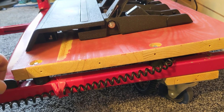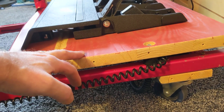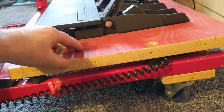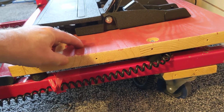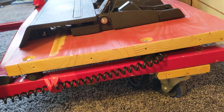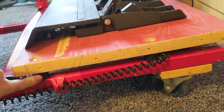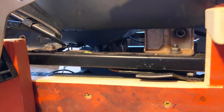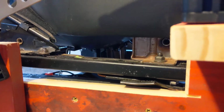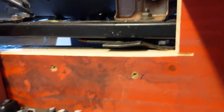Molecular level, that makes no sense. This is floating more, so subtle vibrations of the transducer are transmitted better into this base and felt. So I don't actually have to turn the power up so much, which is good for the transducer. So yeah, isolation is good. I'd love to see what would happen with the ButtKicker if it was not isolated, and I might try that to see if I can turn that up and get more of a vibration through the whole chair. But I'm kind of done experimenting for now.